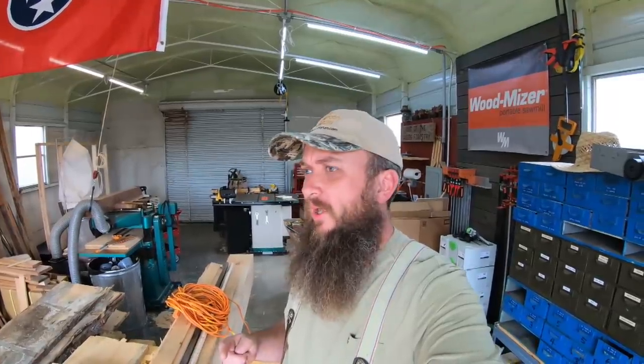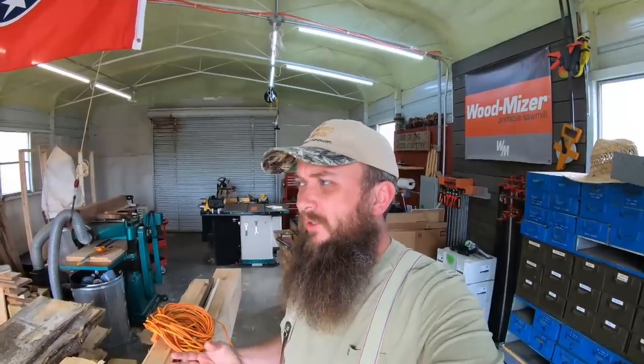So we're talking about that poplar. I put it in there Friday when Curtis brought it over. Yesterday morning, which was Wednesday morning, it was showing 7% in most of the boards. That's pretty fast, but it's four quarter lumber. I think he said 80% of that lumber had been air dried already. There were only a few boards that felt kind of heavy, and most of them showed about 10 or 12% moisture content. So that's pretty fast. Friday, Saturday, Sunday, Monday, Tuesday, right at 5 days to dry that down to 8%, then 24 hours at 150 degrees to sterilize it.